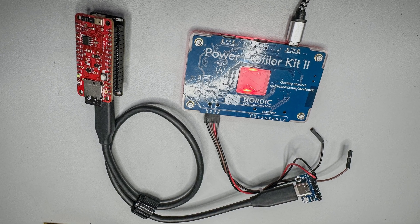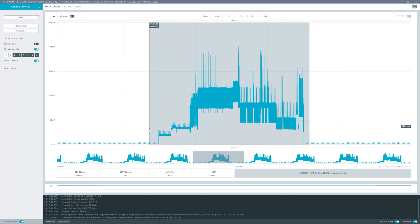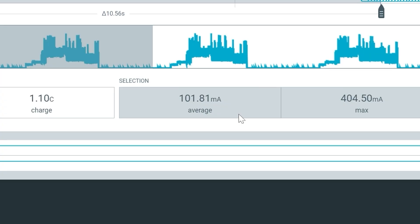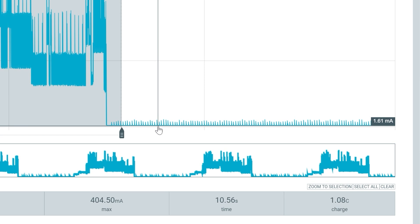Since this is CircuitPython, I was a little bit worried about current consumption. So I connected a Nordic Power Profiler Kit to measure current consumption of the device. My capture cycles look like they're taking an average of about 100 milliamps. If you look at the rest of the waveform, you can get a sense of what's going on in the code just by the current consumption. When the ESP goes to sleep, it draws 1-2 milliamps, which is kind of high.